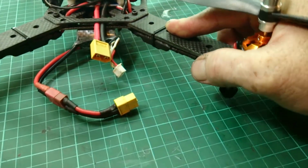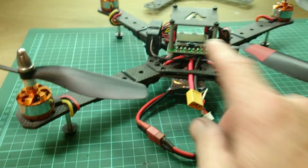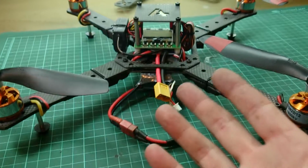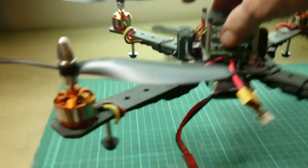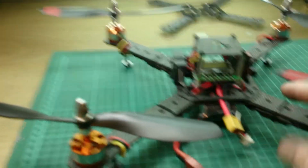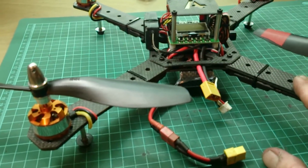You need to use quite a bit of strength to bend them, but there is not enough bend to create any kind of problem with the flight controller, keeping that thing rock solid. And what this means is essentially, for an acrobatic platform, you get the best of both worlds. You get a quad that's going to hover solid, that's going to fly very, very well, just like an aluminum frame, like I use on my other model, 6061 aluminum.